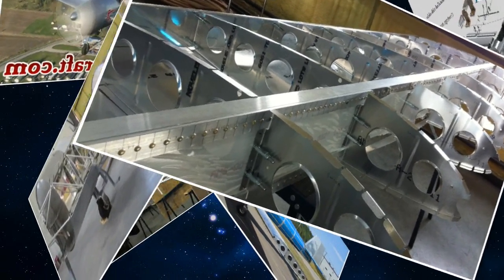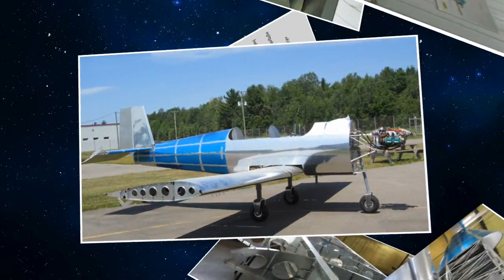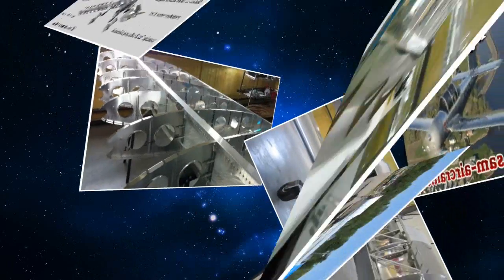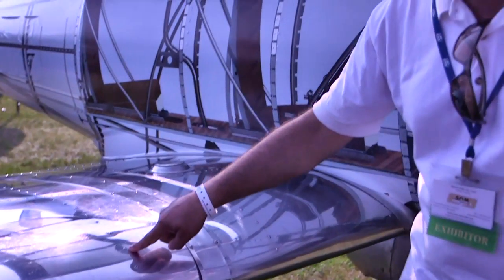What type of kit is the customer going to receive? Is it something that requires a lot of bending and welding? Well, we try to make it easy for our customers so all the welding is done by us. A 4130 protection cage, for example, from the firewall up to the rear passenger seat is done by us. The bending of the leading edge is done. There are holes on the skin, holes on the rib — it's a match-holes assembly. The builder has to align everything, enlarge the holes, deburr and rivet. So it's really a first-class kit.